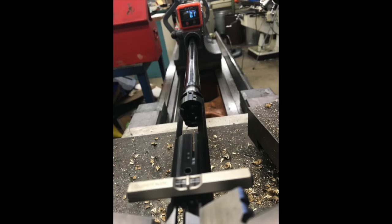I did set back up in the mill and drilled out the barrel shank and repinned the barrel to the receiver. It would take a very experienced eye to see that anything has ever been done to this rifle. I think the motorheads among us might say that we've just built ourselves a sleeper Ruger American Rimfire.